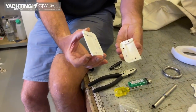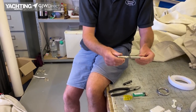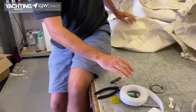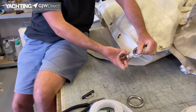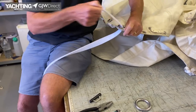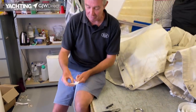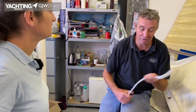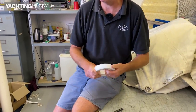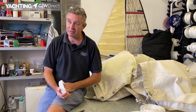One of these batten pocket end repair fittings is quite handy — they just bolt onto the sail. If you've got in-mast furling with vertical battens, take a couple of batten joining kits and some spare battens. For normal slab mainsails, if you get a problem with the bolt rope on the corner of the clew, you quite often get damage there where it starts to tear as the leech loading comes on. You can use a load strap — the kind all the race boats used to hold their clews on — take it through the sail and around the boom, do a couple of laps and stick it on, and it will take the load off the bolt rope. You can also get a narrow version for going on the front of the furling genoa to stop it pulling against the sail entry. I'd also carry some Dyneema, and that will cover pretty well everything you need in terms of sail first aid to get you back to port to a sail maker to fix it properly.